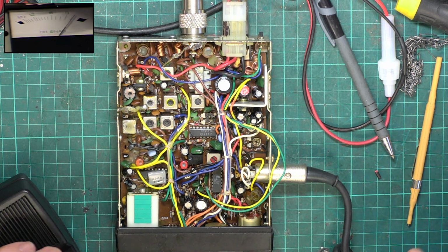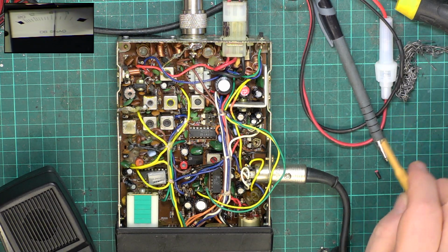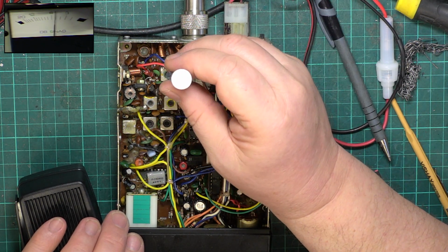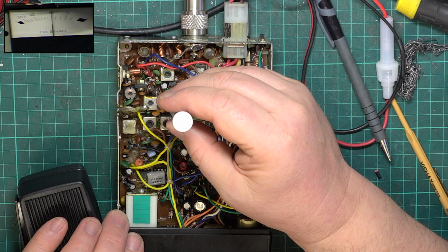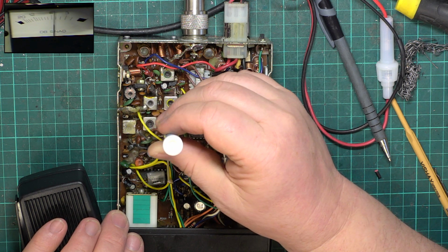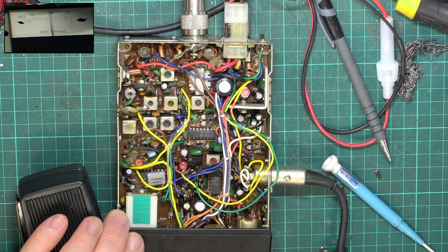So at the moment 0.3 microvolts is that, which is pretty rubbish. So we want about 4 decibels on there to make it easy, and we'll go through the receiver. We've gained a fraction there. Gained nothing there. Nothing there. This is IF, so I just need to do a different type of thing. We'll have it about 12, and I'm looking at the shape of it.